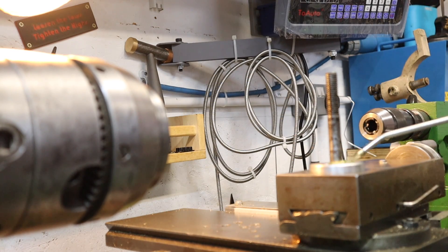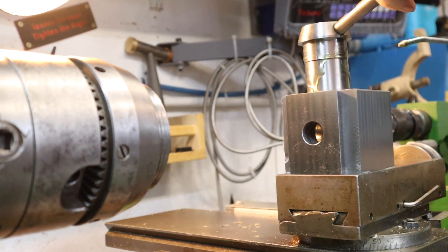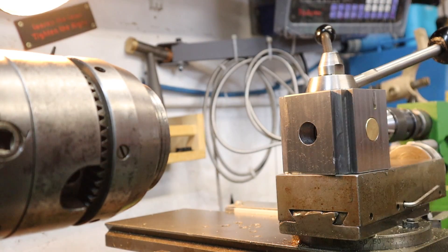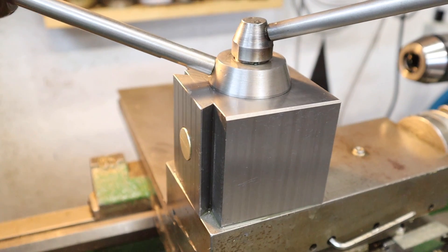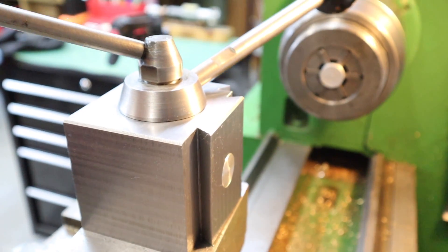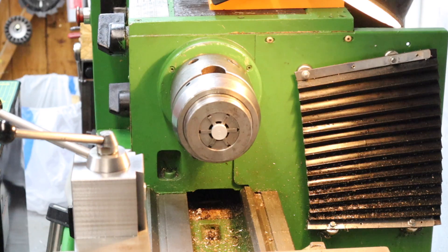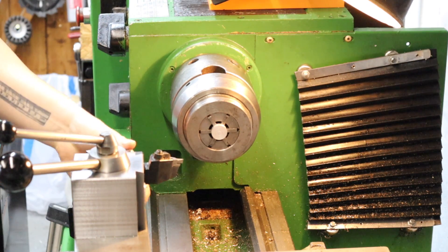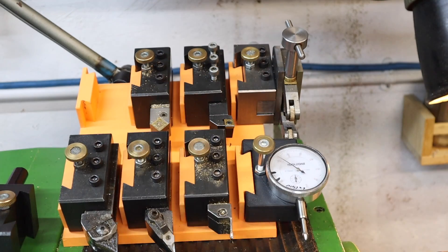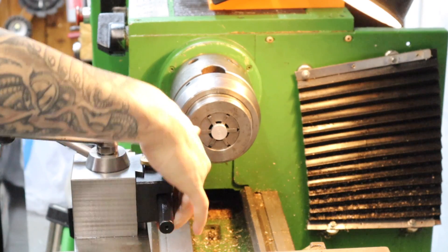With all the machining done, the last thing left is to assemble this and give it a final test. Oiling everything as I go, in go the pistons - and can I just say how good do surface ground parts look. Something I've never done before but I'm going to do on every part from now on because it just looks amazing. Taking one of the turning tools out of storage, it locates on there just as it always did and secures nicely. Now when I want a boring bar, I can grab it and locate it - simple as that, no rotating the tool post. That's a win.